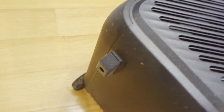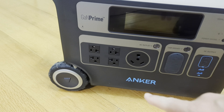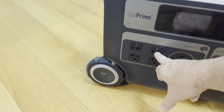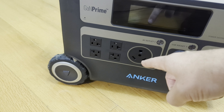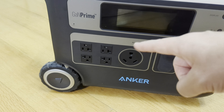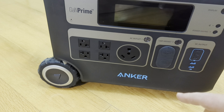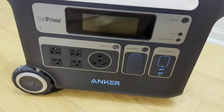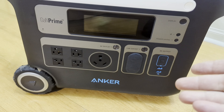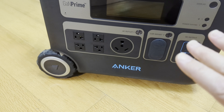Just your simple run-of-the-mill battery pack. I was glad to see they fixed the sockets, because I found one Amazon review showing these were also backwards — just like mine. They had the neutral and hot reversed. Then it got worse when you were charging it and turned it off: they would do a reverse hot and ground, which was bad. So they shipped me another unit, but we still had some issues with the inverter. I'm hoping they fixed all the other units for people, because having reversed neutral and hot is not good.